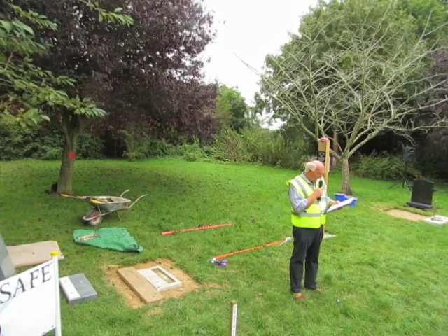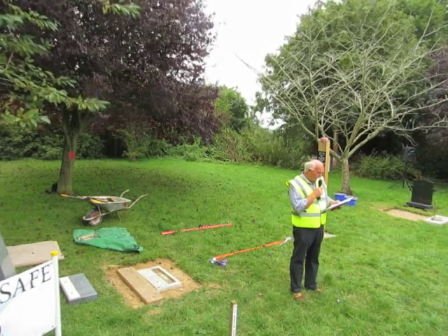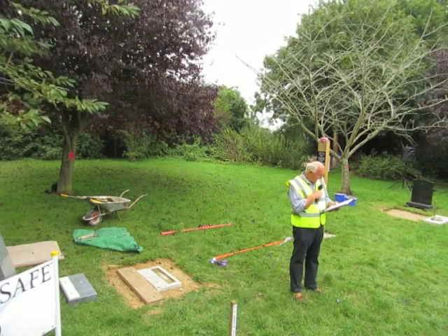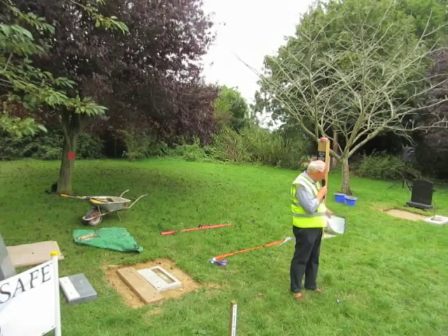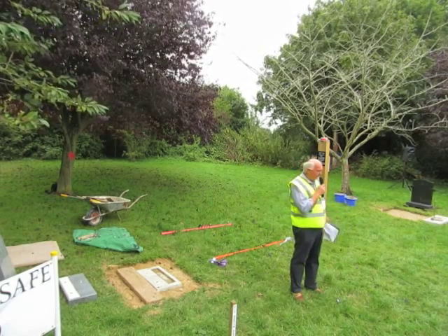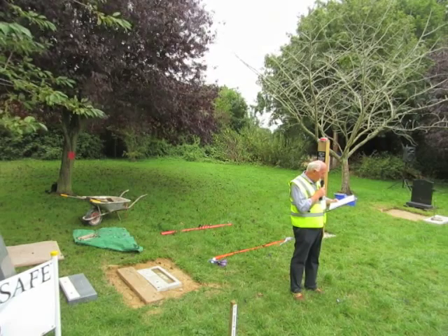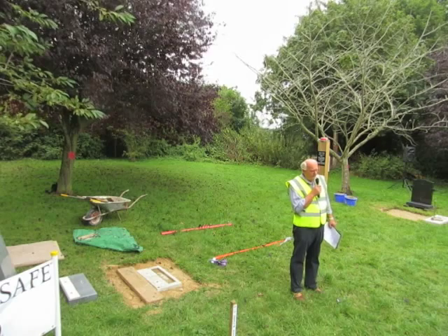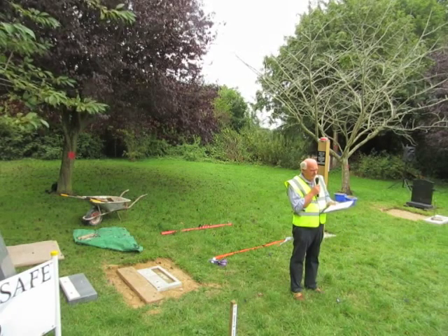The required soil condition is medium coarse sand — a very sandy material with fine crushed grit of about 5mm in size. You can see that we've dug two pits out, one at 600mm and one at 750mm. They are 1 metre by 1 metre, to allow the free flow of the anchors to come up through so we can observe what happens.